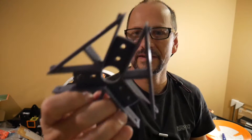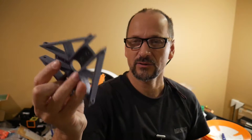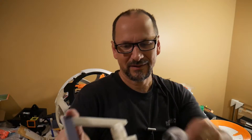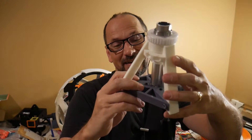There's also this stiffener base that I have here. You'll notice it has inset nuts — just press fit, sometimes hit with a heat gun. This is what really attaches the whole thing to the sphere. There are matching holes that go straight through the sphere all the way to the outside, so this all gets clamped together. This goes together like that — I'm not going to screw it together because this actually screws to the sphere, but you'll notice there are holes in the edges for screws that go all the way through as well. Then this goes in here and voilà — once all the screws go in it's rock solid.